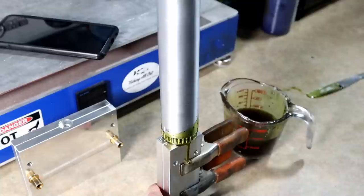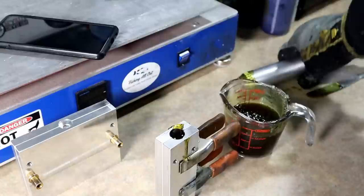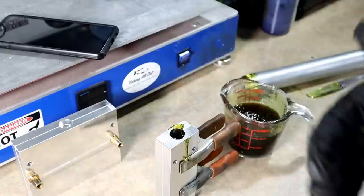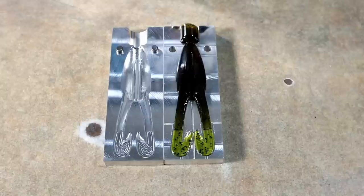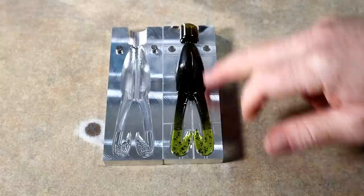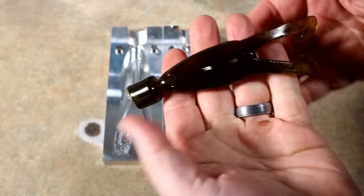The real version of the mold is most likely going to be a three-cavity, and it will not be single top-port injection like this. Top-port injection, single port, is always probably the most tricky kind of mold to inject. Josh is obviously working on mold configuration to make it the most user friendly. Look at that — you can see it's kind of more brown up here, more green down here. With MF dark watermelon you can see much more brown here, much more green here.